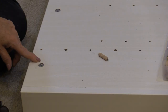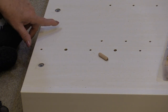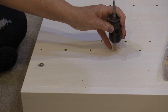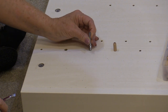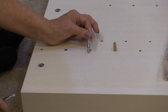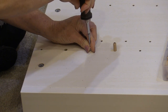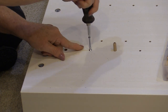The directions have us laying the table legs down so we have all of the holes facing up. We have two toolbox cases with all of the screws and things we're going to need. We're going to need these little wooden dowels — they fit into the larger holes. We will also need some cam locks. You will see a little arrow; the arrow will need to point on the outside of whatever we're working on, and this little piece locks inside. The cam lock is already put right in the top so that arrow needs to point to the outside.